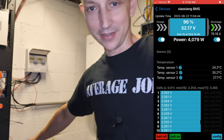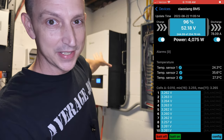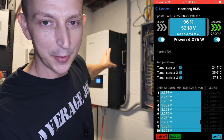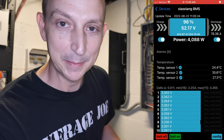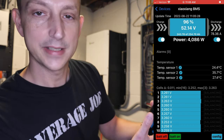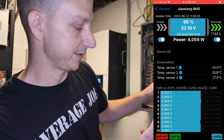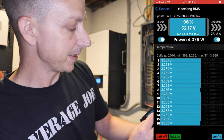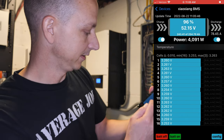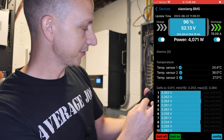We're back downstairs and I'm pretty damn excited that we're running the air conditioning off the Rhino down here. Sorry for the inverter fan noise, but we're running stuff - we're running an air conditioning for the first time. This is the first time I've ever been able to run the stove or the air conditioning off this inverter. This is pretty damn exciting. We are still drawing 78 amps or 4,000 watts. We don't have the solar connected at this moment because we're just testing the battery only. The battery cells are all sitting at roughly 3.26 volts according to this app.